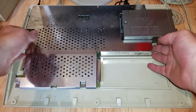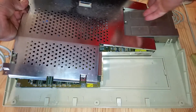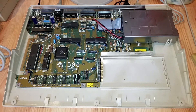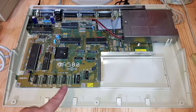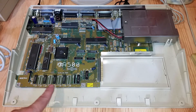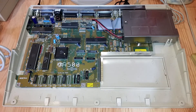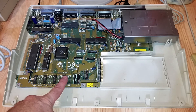That leaves access to the board. The memory is down in this area - you've got the four chips which give you 512K, and you can see in between there's space for four more, which are the chips I've purchased, which should give me space for one megabyte. As you can see on the silkscreen it says 512K/1 megabyte of RAM.